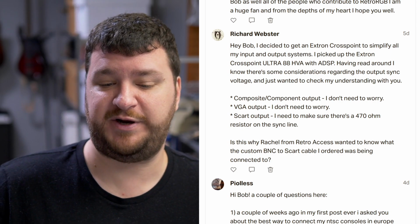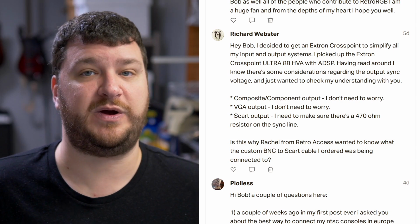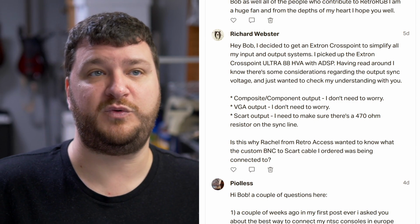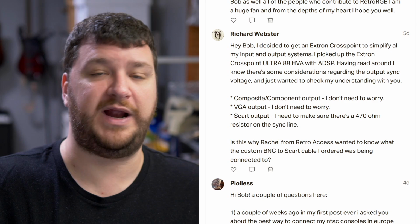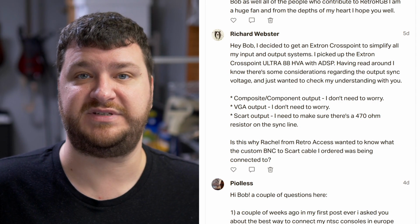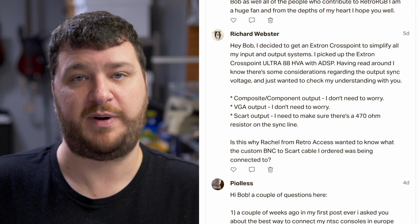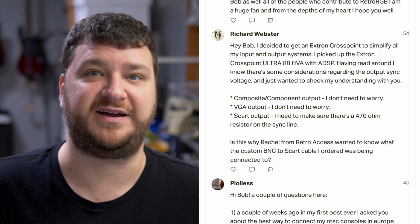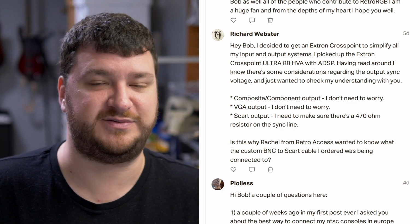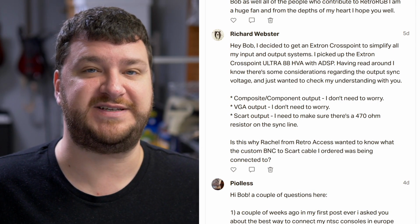So yes, that's why Rachel from Retro Access wanted to know what the custom BNC to SCART cable was for, and that's why you need the 470 ohm resistor on it. And the very good news is, if you erred on the side of caution, if you or anybody listening said, I need to go from BNC to SCART, and I want to make sure I'm safe, so I'm going to put the 470 resistor even though I might not need it, the worst possible thing that could happen is you don't sync. So all you would do is then remove that resistor, wire it back up directly. It's super, super easy, and that's it. So if you're wondering, I would always add it just in case.